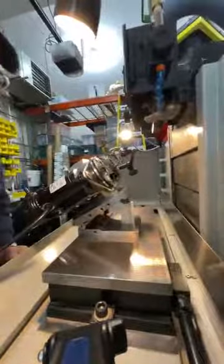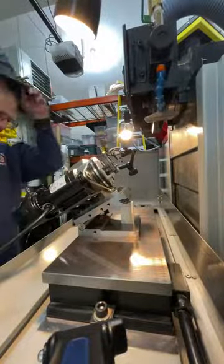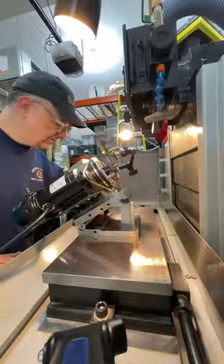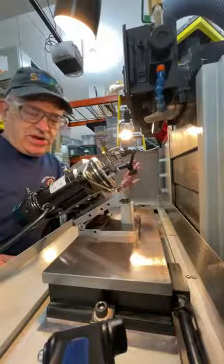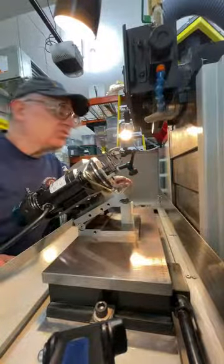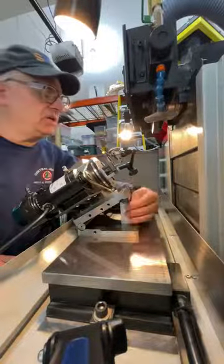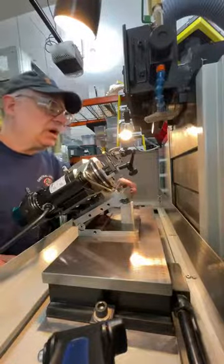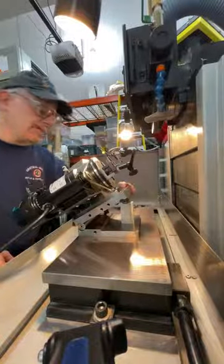So this is how we're putting in our relief. Just to remind you that the first time I did this, I put in too much. I didn't like it. I ran with it and didn't hurt anything, but I wanted to regrind it. So nothing else is changing. The angle is still good. I'm checking my gauge blocks are still tight. Everything else looks great. So I'm going to take my indicator off.